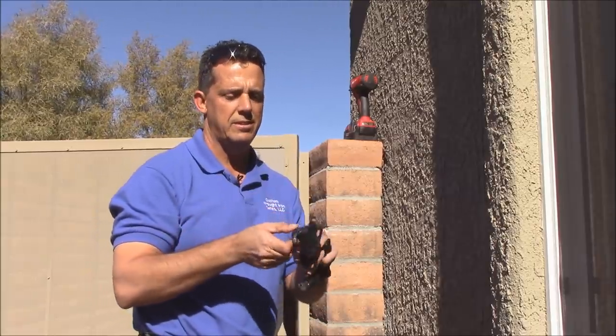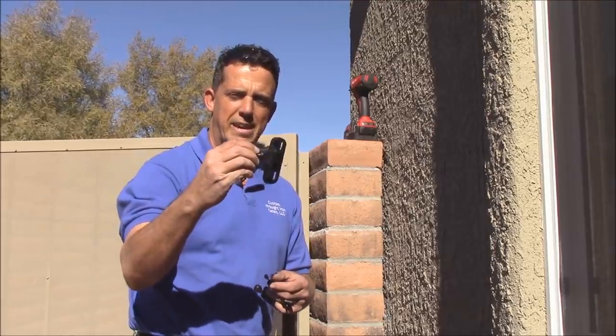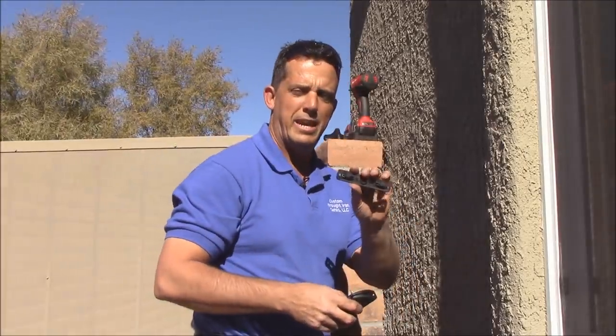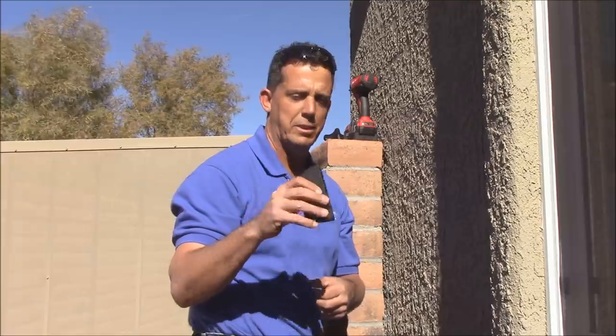This is the finger. It's got a stainless steel finger that comes out. The mounting is actually grooved for adjustment so it can go up and down. Here's your lock, your latch, the built-in key. For this application we are going to be using the shim, the mounting shim. It goes right in the back like that and snaps in place.